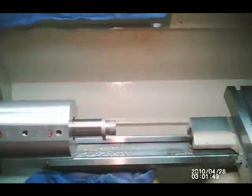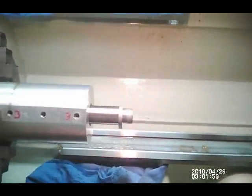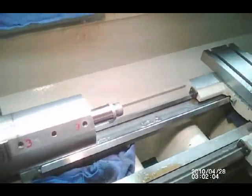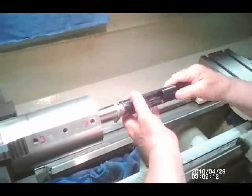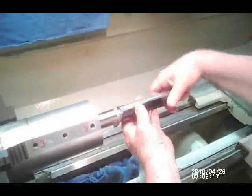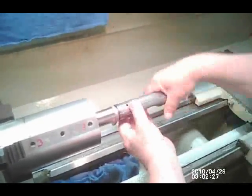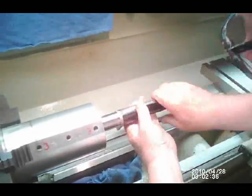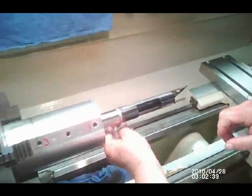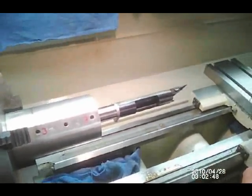We're now going to fit the action on. My helper today in the lathe cave is Mr. John Millington, bench rest shooter from Illinois. John's going to check the tang and wiggle it to see if there's any play. There's a very minimal amount of play, and with all Remington actions, as it gets down to the bottom of the threads they tend to get a little tighter. It's nice and snug, no wobble whatsoever, and it's going to lock right up against the recoil lug — which is snug and not going to move.